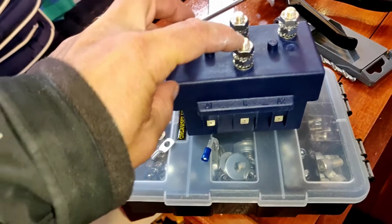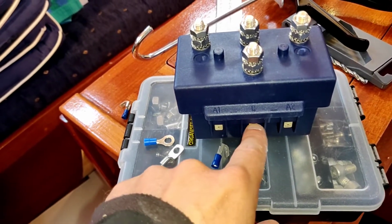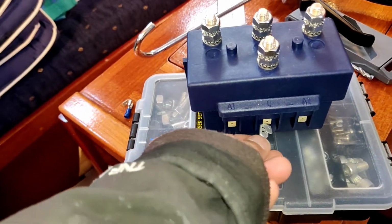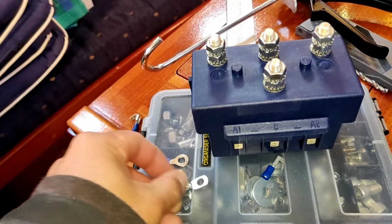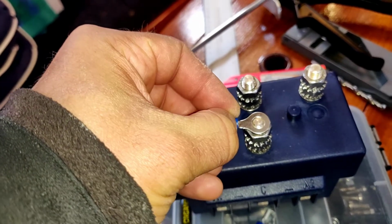So that's the battery negative. This one will need to go to battery negative as well. So I'll just connect this one with a small cable up here. That's it. So I found a few terminals. That one works. My usual one is a bit too small. That one won't work. This is a little bit bigger. I'll just need to drill that one out.